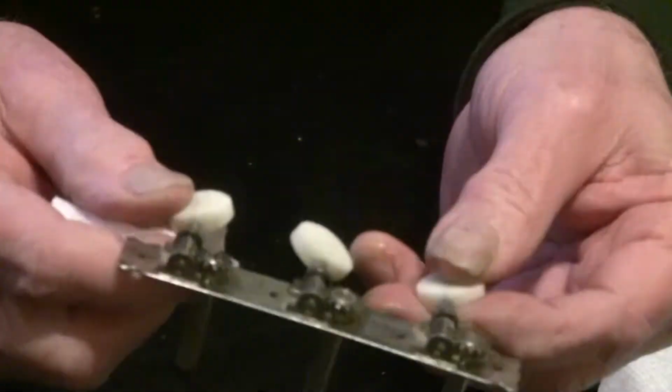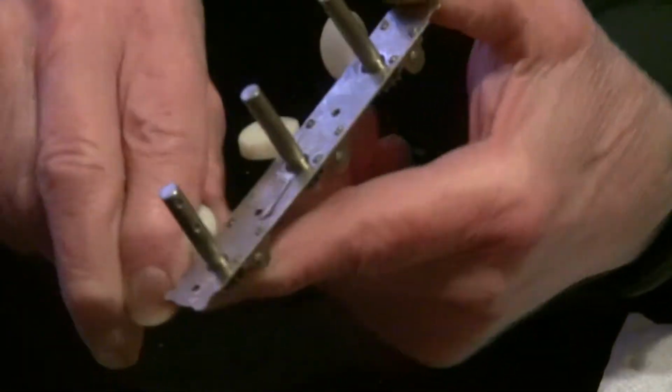Now, my little rant. Tuners don't slip. Tuners don't slip. I'm a mechanical engineer. I design robotic positioning systems in X and Y. We use ball screws. They're frictionless things that you'll still use a screw, but there's ball bearings in it. But when we get to the Z-axis, there's gravity. And we use a worm gear.